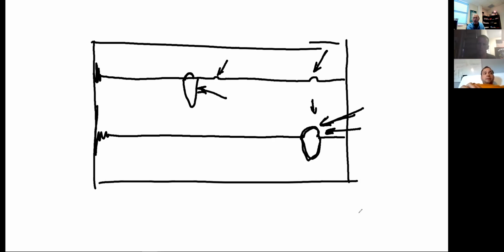Is the guy walking on the ground okay? Yeah, he's all right because it's arcing into the earth and the ground, not his feet. There's no step potential going on down there. It's on the surface where step potential happens. Always inform your fellow employees you're getting ready to thump. All right, 35,000 volts DC. Okay, any questions there?